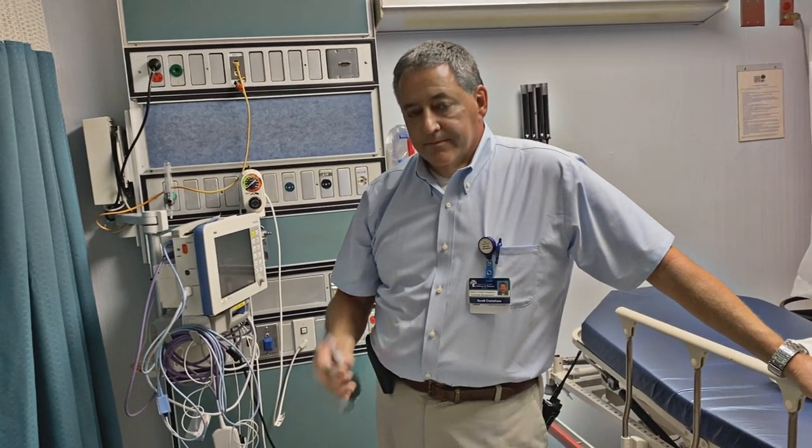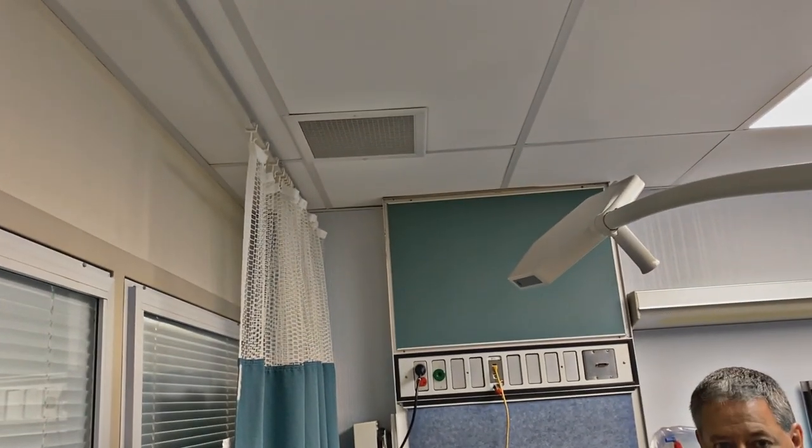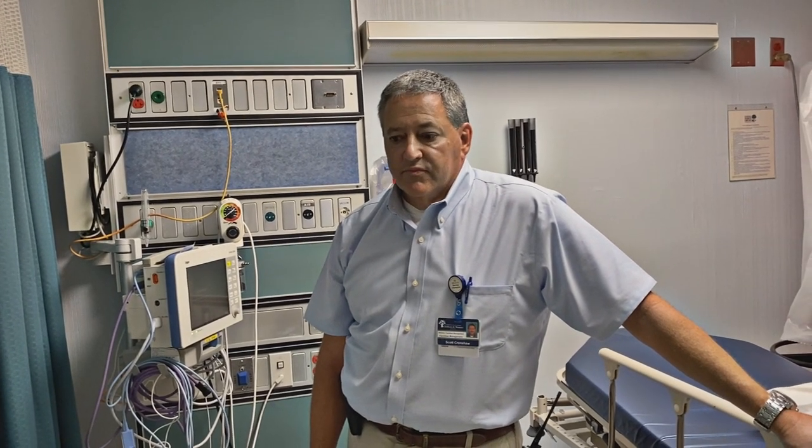Surgical suites. So we know those air scrubbers are pretty loud — where's that air scrubber sitting? It's in the room, in surgery. It vents out through a return — a low return right down low between the laminar, so it's easy enough to access. Does it make an overwhelming noise? No, OR suites are so much bigger than this ER room, it's not as bad. Those rooms are six times larger than this room, so it does drown out a little bit better. In a surgery room we're putting in almost 2500 CFMs, and it takes a lot of return to overcome that. Hey, thanks so much for doing this — I think there are people out there who will really appreciate the information.